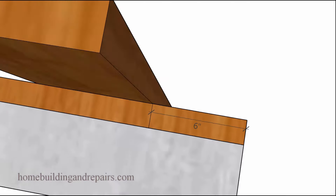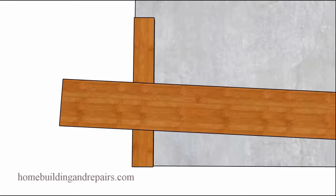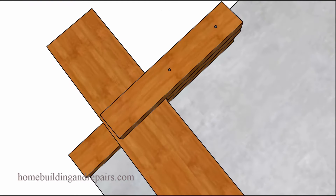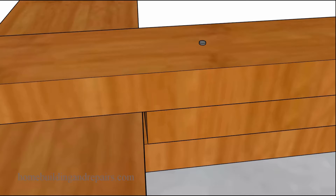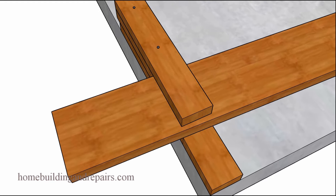There's our 6 inches. At the corner, remember we need to line it up with this side. With our 2x4s sitting on top of the concrete foundation — nice and square — and the edges lined up with both sides of the building foundation, we can position our roof framing lumber at the top and the bottom. We're going to measure from here to here, then subtract the amount we want for the desired depth of the seat cut. Here I'm making my seat cut about 3/8 of an inch at the top.